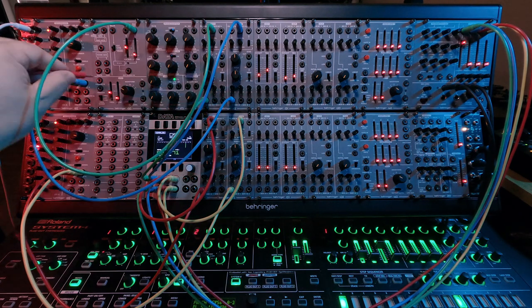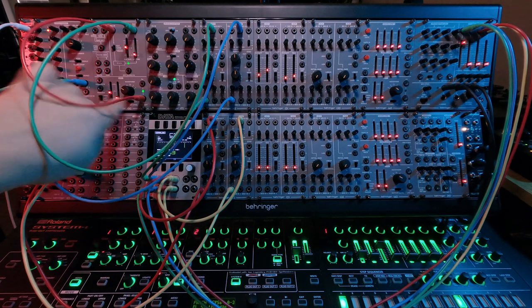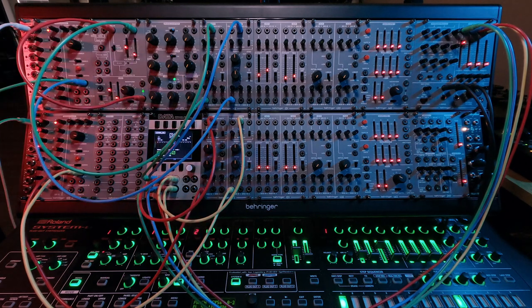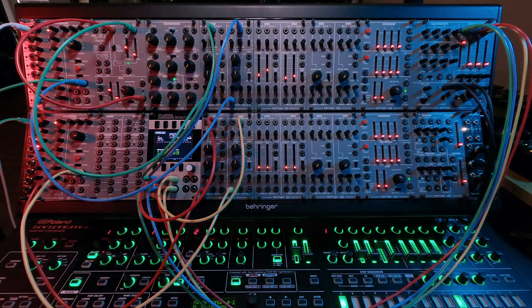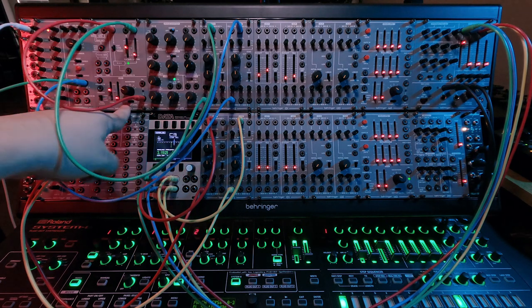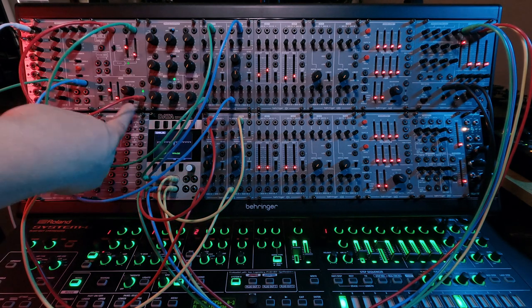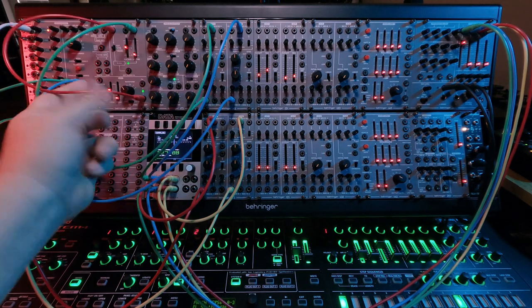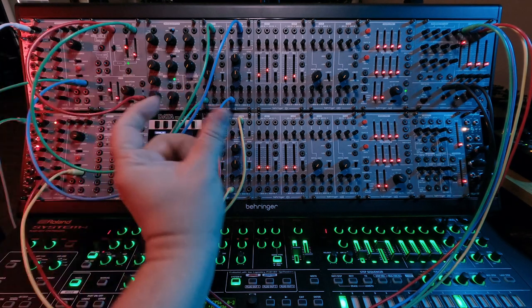Let's try that real quick. Let's take an LFO out to the SIG in. Divide it by 10. So see, now I'm kind of wrangling that in a little bit. So it's following the LFO up and down, but it's following it only on a divided by 10 basis instead of the full range of the LFO. So this is the full range of the LFO, whereas this is a small bit of the LFO.